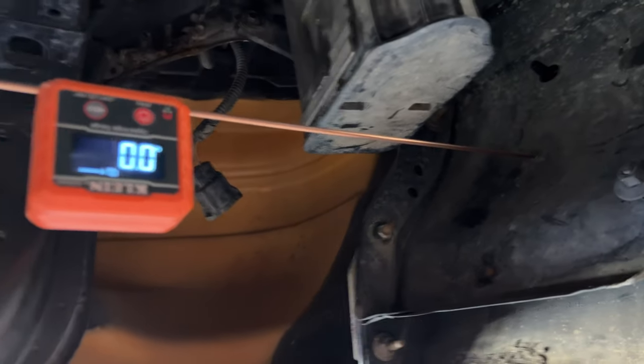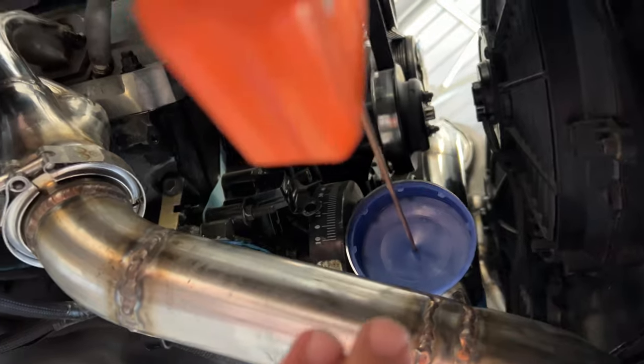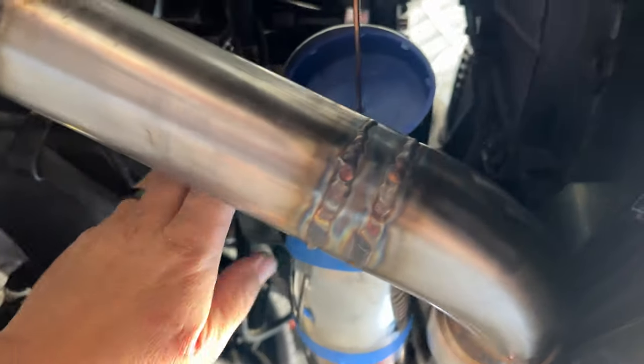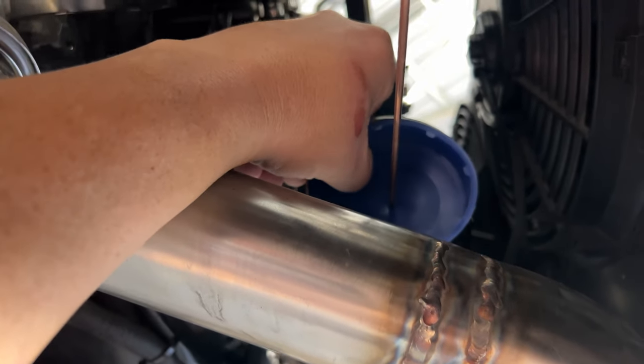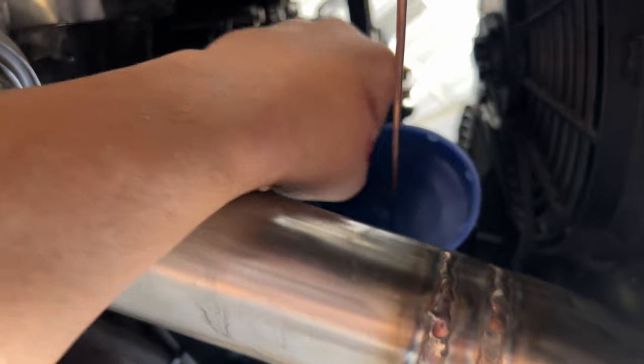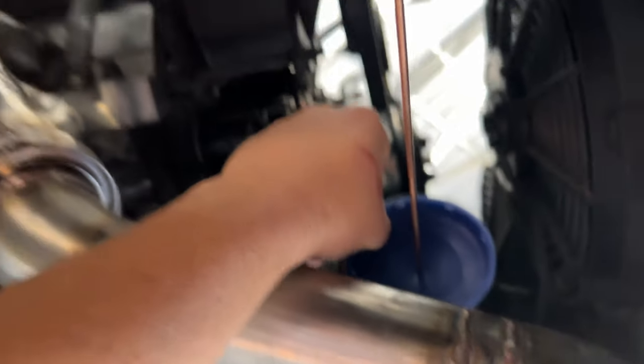Right now I am getting ready to drill a hole in my fender. And so all I did was took one of the 3.5 inch caps. I think it's 3.5 inch. I've got it pushed in here, but it fits in this 3.5 inch tube that I used. Poked a hole in the center, got this thing level with a piece of welding wire, and now I know that's where my hole is gonna be. So I'm gonna get that hole drilled.